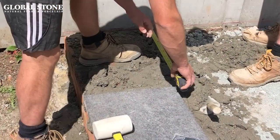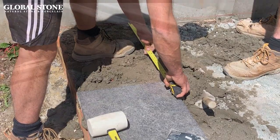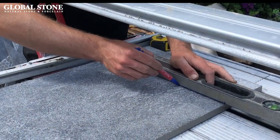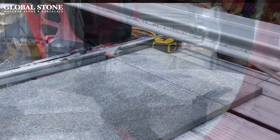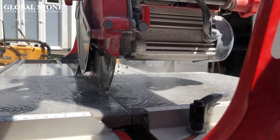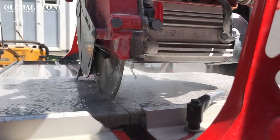On some occasions you will need to cut your paving. Make sure you measure the area you wish to cut first. Porcelain paving tiles are best cut using a power saw fitted with a good quality continuous rimmed diamond blade which is water fed and is specifically made for cutting porcelain. Alternatively, you can use a traditional tile cutting blade.